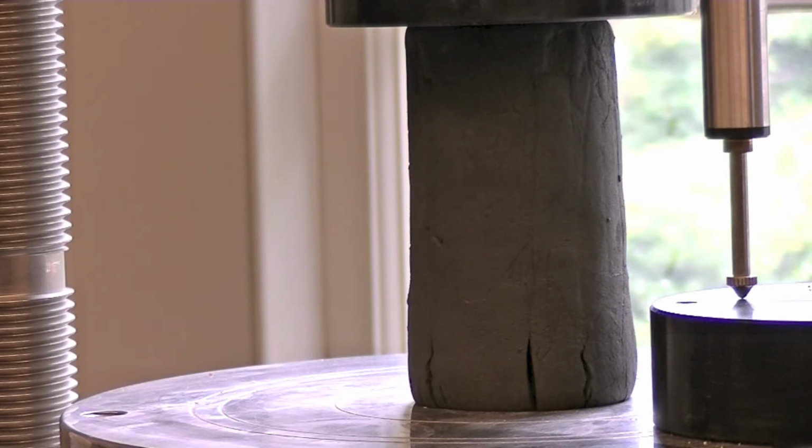So imagine a soil column pulled from the ground without any confining pressure, as shown here. If we broke such a specimen that could remain intact, then the results would not emulate field conditions. The compressive strength would be much higher in reality because surrounding soil would confine such a specimen, increasing its ability to resist vertical forces.